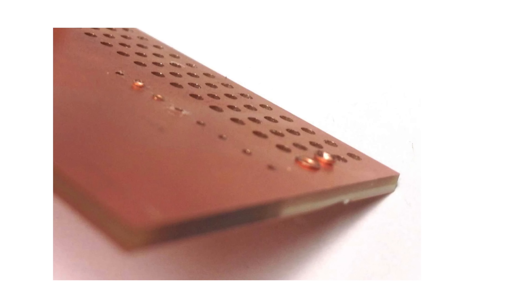These are always going to be bigger than a normal via you could get from a board shop — I guess you could just ship with that larger via diameter, but that's going to be a design constraint. And also, these rivets take up a little bit of height, so it's going to be really hard to get some of these underneath an IC, for example.